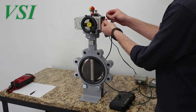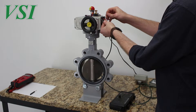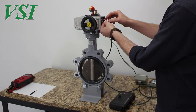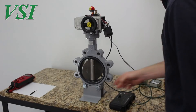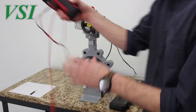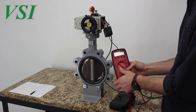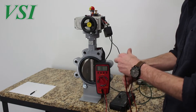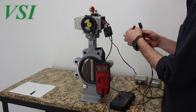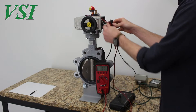Using two short pieces of small single strand wire, such as safety wire, insert them into the connector on the purple wire and either the pink or orange wire. The pink and orange wires are the potentiometer's power and ground, while the purple is its wiper. Connect your multimeter to these two wires and set it to read resistance in ohms. The potentiometers in Series 1000 electric actuators have a range of 1000 ohms. While at mid-travel you should get a reading of roughly 500 ohms.